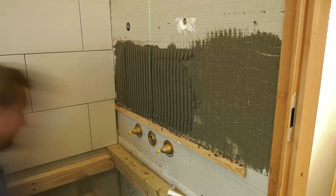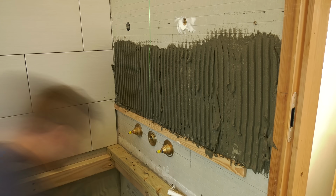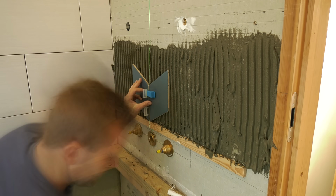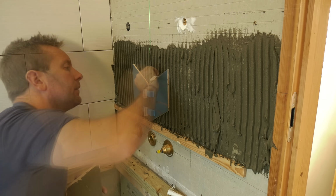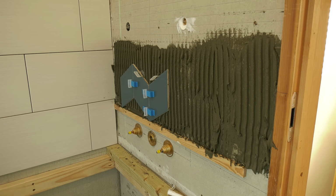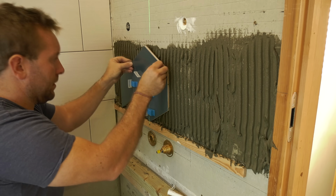So for those of you who watched me tiling the floor or tiling the wall in the previous videos in this series, you're going to realise how important it is for us to get our tile adhesive lines in nice straight lines so it can go off nice and easily. That is important, but if you cannot do it because the tiles are small or you're in a very small gap, and we're going to be in small gaps later on in this video, then I'm afraid you're not going to be able to. You're just going to need to leave it to go off for longer.